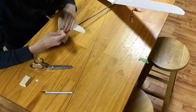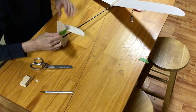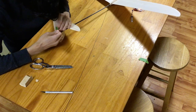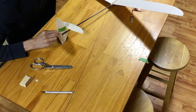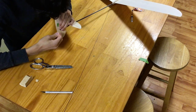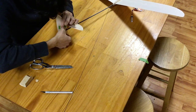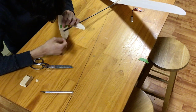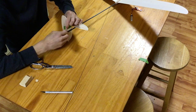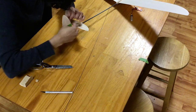You'll now make sure the pull cable is pulled tight all around. Remember that little areas of slack, such as between the tail boom and the control horn, or in the individual wrappings around the control horn, can easily go unnoticed and can lead to some wonkiness in the control responsiveness later on. So make sure it's tight everywhere throughout the entire linkage from servo to control horn. Also remember that the sharp edge of your metal control horn can fray or cut your control line, so don't pull too tightly right at the control horn. Instead, isolate the individual loops of thread you've wrapped around the control horn and tighten them each individually, similar to how you might tighten up a double knot on a shoelace.